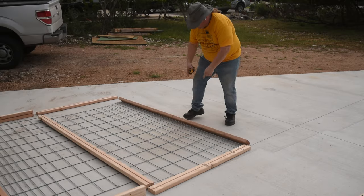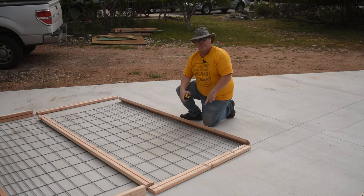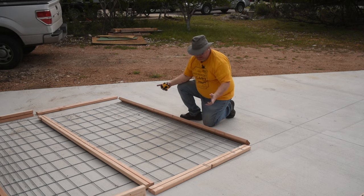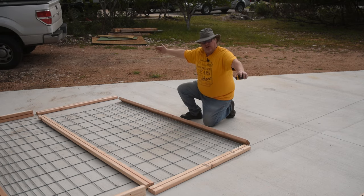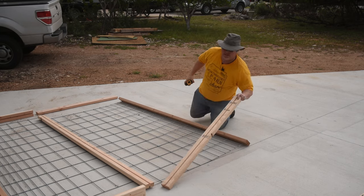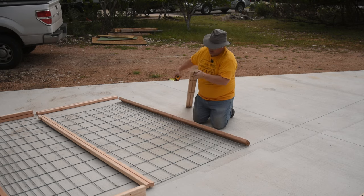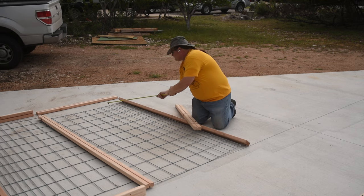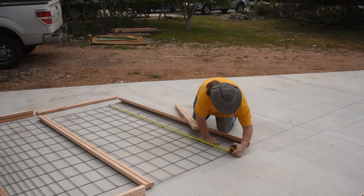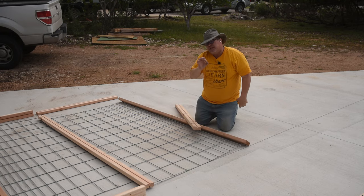Now to get the width of this item, ideally, because this is the gate, so I'm not having to worry about uprights that are out of line, you could do the same exact thing. Put the two ends on it, measure them out, and then measure from the outside to the outside. Or if you actually trust your abilities, that what's left of your dado, the meat of it, what's left after it, is actually 1 inch in my example on all your boards, you could just measure your gate. Mine is 88 and roughly an eighth inch, we'll say a quarter inch, and add 2 inches to that. Plus maybe a little bit more for that